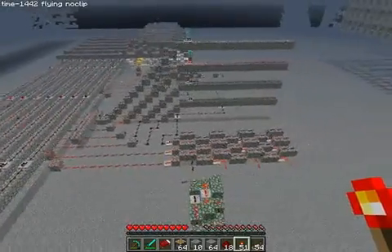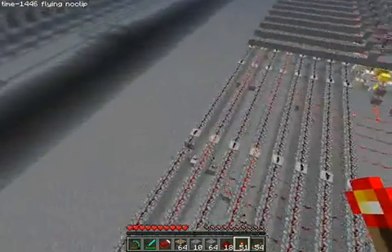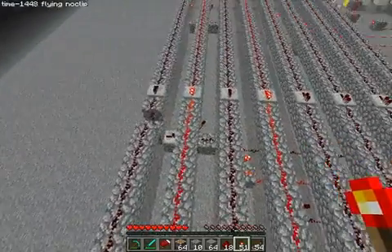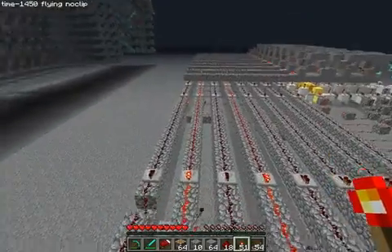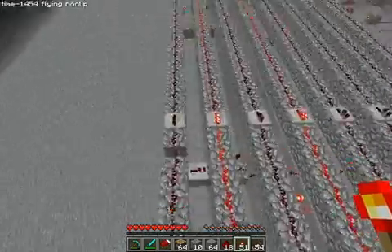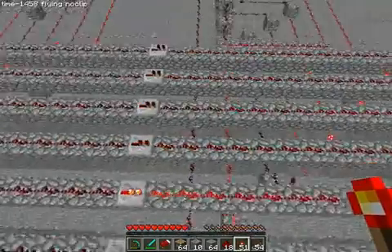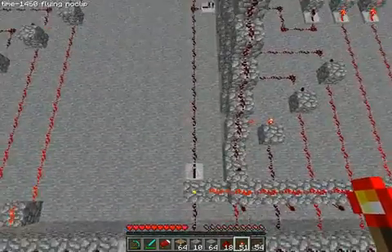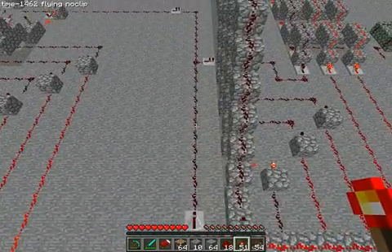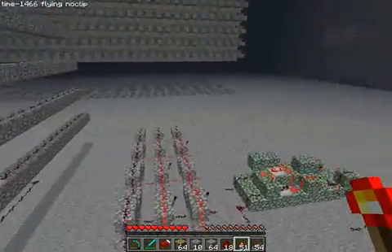This is the basic framework I'll be using to add the registers onto. The opcode I've decided to use for this is 01. For branching, we used 11. So you can see here, 01 is already selected on the bus from the instruction up there. That allows the line that comes out here to be dark, which acts as an override for this MUX here.